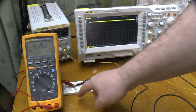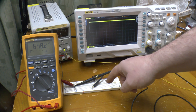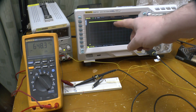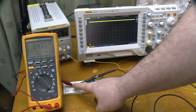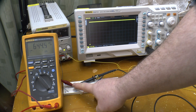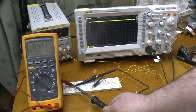Here we have the transistor in circuit. All it's got is the emitter connected to ground and the base and the collector tied together, fed via 20k of resistance to a 5 volt supply. The reason for the 20k will be apparent later. What you're seeing on the meter and on the scope is the voltage between the base and the emitter. But if I heat it up, even with a fingertip, you can see that voltage is starting to drop. When I let it go, it goes back up again. If I heat it up with a soldering iron, you can see that it drops really quickly. The Arduino has input pins which can actually measure this.